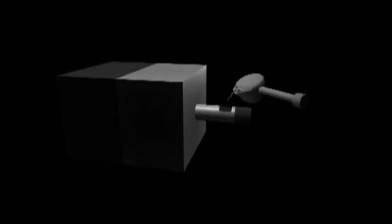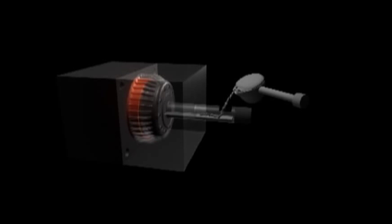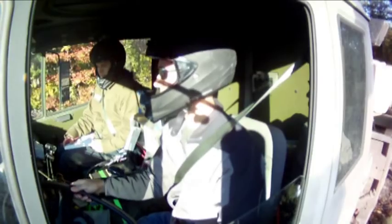Century's patented ring extruder technology enables the precision mixing required to produce consistent porous ceramic preforms from silicon carbide. The highly porous ceramic preforms are then infused with molten aluminum under extremely high pressure. The resulting drum is then machined and prepared for installation.